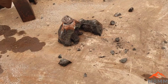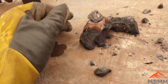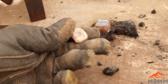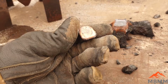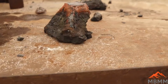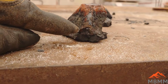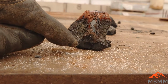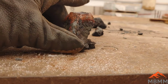All right, guys. Well, I got impatient again, and it's still kind of gooey in the middle there. But we got a little metal prill on top, and look at how nice and coppery colored that is. So we got some metal, that's good. There's a thin little layer of slag, and all that is sulfides. So I probably added 10 times as much sulfur as I needed. But boy, it did its job.